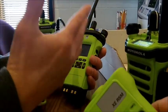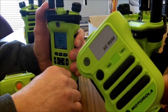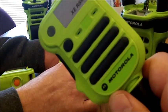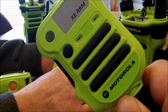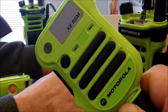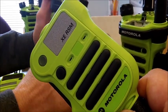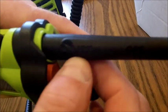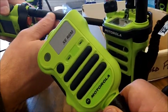These are FM-approved radios with FM-approved accessories and batteries, meaning this radio does not spark. If you're working in a natural gas area, agriculture, or a dust area where a spark could cause an explosion, these radios will not cause that. They're also P25 compliant — currently we're still on analog, but you can switch to digital anytime simply by reprogramming. These are VHF radios, not STARCOM. You can tell by looking at the antenna label — this one says VHF. A STARCOM would say 800/700, or a combination radio would say VHF 700 800.